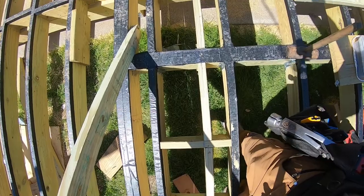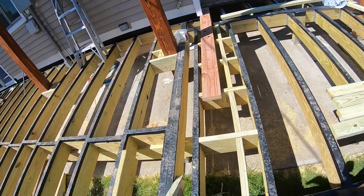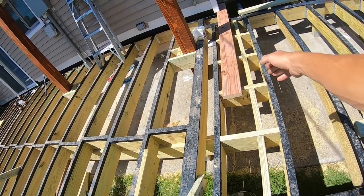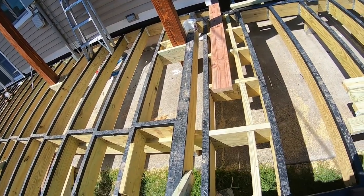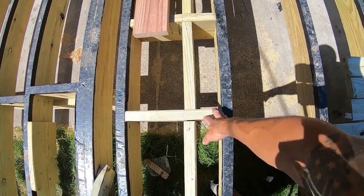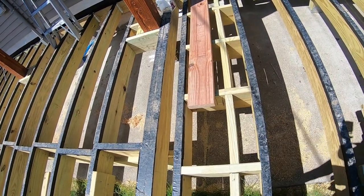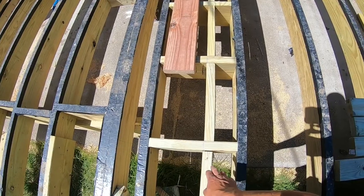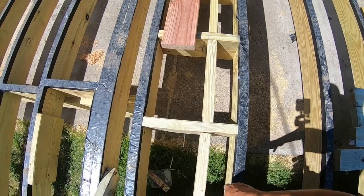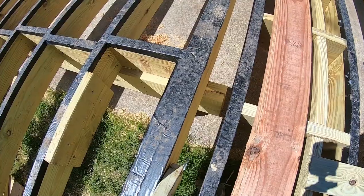You can see that two by six off the house — that is going to be our divider. Our field deck boards are running perpendicular. Our divider is parallel with our joist. So we did our pressure blocking 16 on center to catch our divider, which is parallel with our joist. Then came in and put this blocking to catch our field boards that are going to come in.